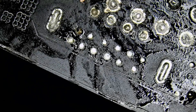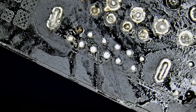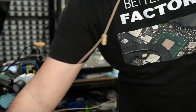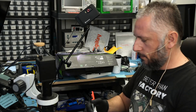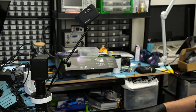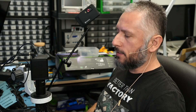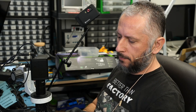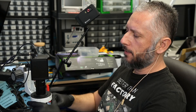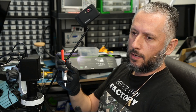Now while the board is hot, we're going to use the NF.Socker, the soldering tool. So right now we're going to be using the NF.Socker to desolder the holes. Some viewers suggested why not have an angled tip? Because right now, to suck solder off the holes, the sucker must be vertical. I cannot place the sucker under the microscope and show you how it's done because the sucker has to be vertical — if you do it at an angle, it's not going to suck very well.